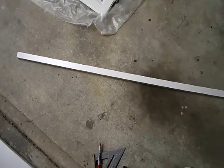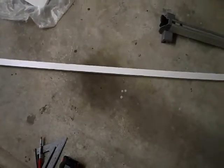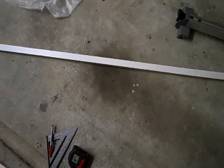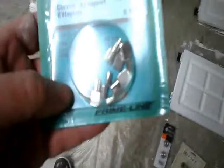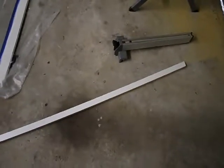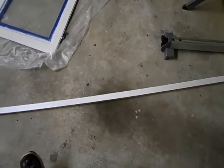This leftover piece from my two cuts on the long board I'm going to use as a brace for the shelf. It's about one and a half by one inch thick, so you could also get a one by two, paint it, and do the same thing. I'm not able to use standard mounting brackets because the back is thin particle board — I'd have to add an extra strip of wood anyway. So I'll just use a one by two to hold the shelves up, cut it to fit inside the cabinet, and mount everything together.